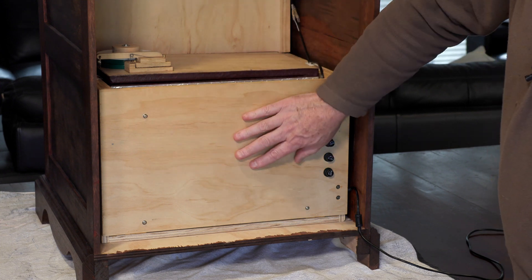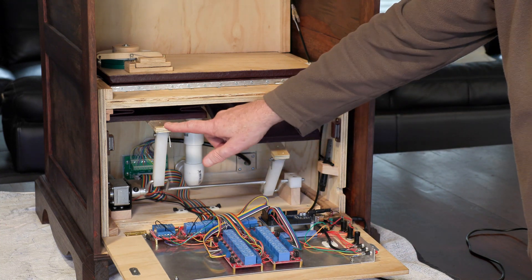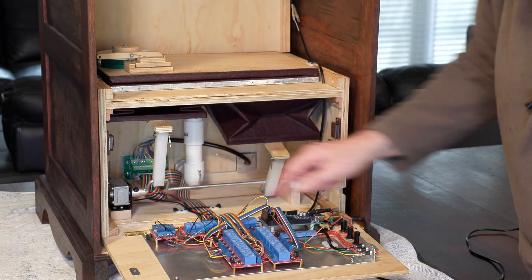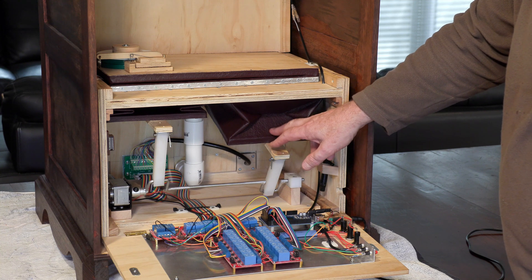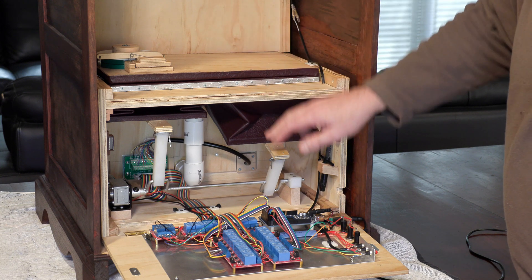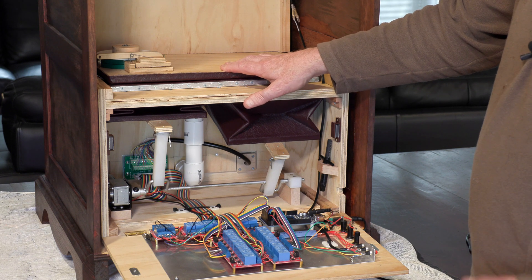On the back here I've got the electronics on the back side of this door, so we'll just fold that down. Underneath here you can actually see the two bellows — this particular bellows is closed, this one is open. The bottom here is a simple crank mechanism and there's a worm drive electric motor over in the corner. The actual design of these bellows was done by my son — he did most of the design work. There's little card glued to the back of these pleats to hold them into the correct shape, same with the air reservoir. This technology, the way these are built, is pretty much the same as on a period busker organ from a couple hundred years ago.